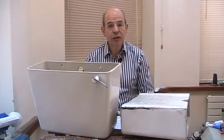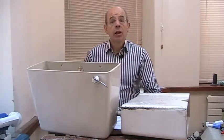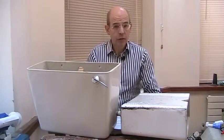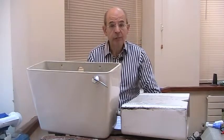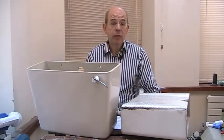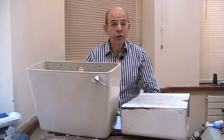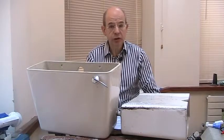You can find out your flush volume if you want by starting with a full cistern, turning the water off, making a mark at the water level, doing your flush and marking the level of the cistern when the water stopped flowing out. Then you can fill it with a measuring jug and perhaps mark the six litre level on the way up until you get to the mark you've made for your full flush — this will give you some idea of the volume you get for a flush if you're adjusting it.